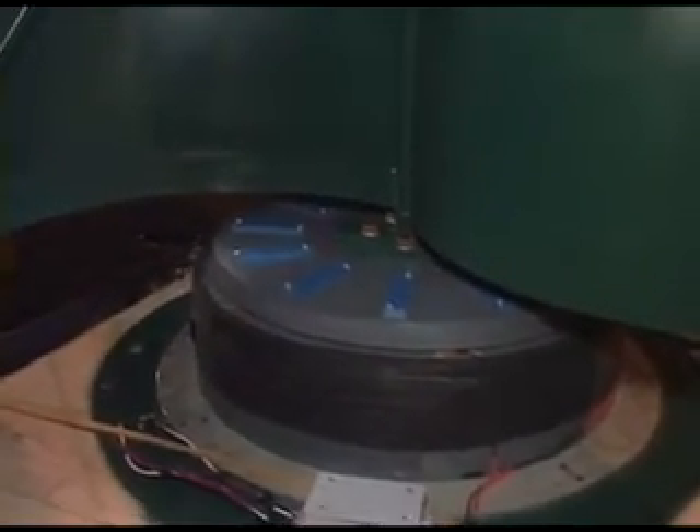We have an emergency feature — in the case of a hurricane you can hit a switch and it crosses the wires and locks the unit up. It won't completely stop moving because as soon as the unit stops turning there's no electricity; it starts to move, creates a little electricity, stops, and repeats. The thinking is that the willow tree bends in the storm and the oak snaps. We want the unit to continue turning even in 200 mile-an-hour winds, hopefully surviving so you still have some power when the storm is over.